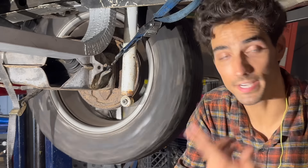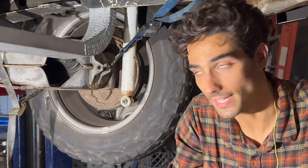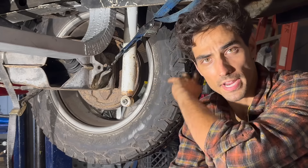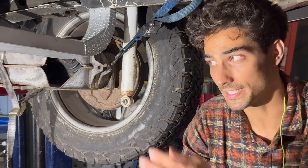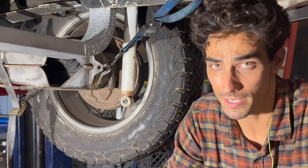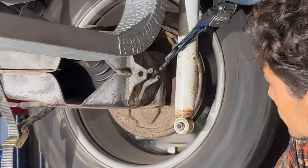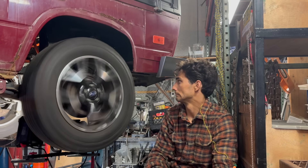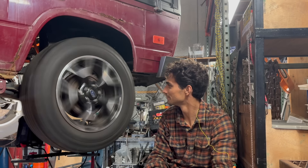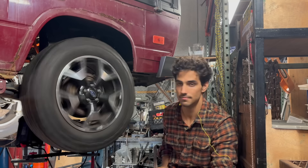So far, so good. I hear the hum or whine of the electric motor — totally normal. It is low on oil, so when I fill that up it will not be that loud. However, I am hearing a little bit of noise coming from the brake drum of the Volkswagen — nothing to do with the conversion itself, just some old brakes. I need to put disc brakes all around on this thing because with a Tesla motor, I definitely want to be able to stop.